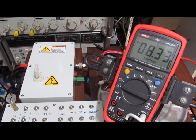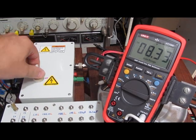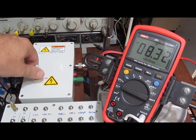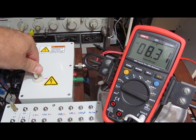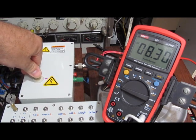It appears to pass functional tests. Let's go ahead and run it through the transient test. This is at 3.7 kV, a 50 microsecond decay into an open, with a 2 ohm source impedance — about 10 joules of energy right now.